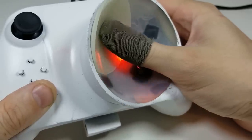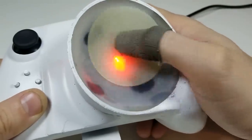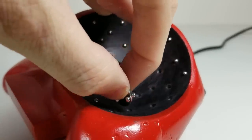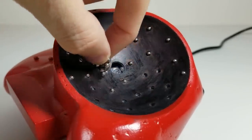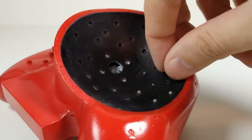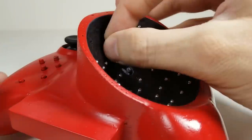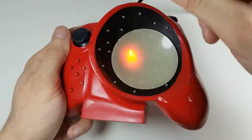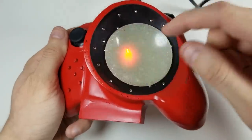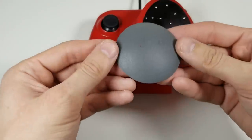If too much friction exists when sliding your thumb across the surface, in-game actions will stutter and be slow. This friction issue has been either too much or too little with every mouse controller build. With mouse controller V5, we came up with a pretty unique solution. We used ball bearings. By using bearings, it gives your thumb the physical feedback required to tell the brain where its current position is, while eliminating that extra resistance that was present when two physical surfaces would glide and make contact with each other.